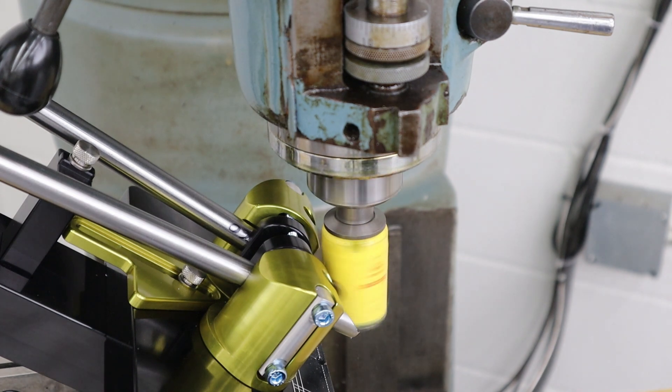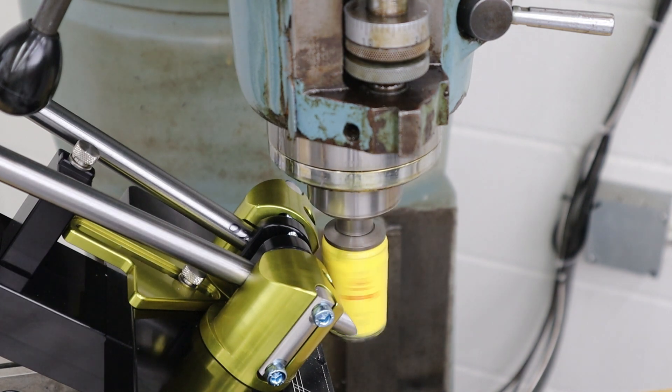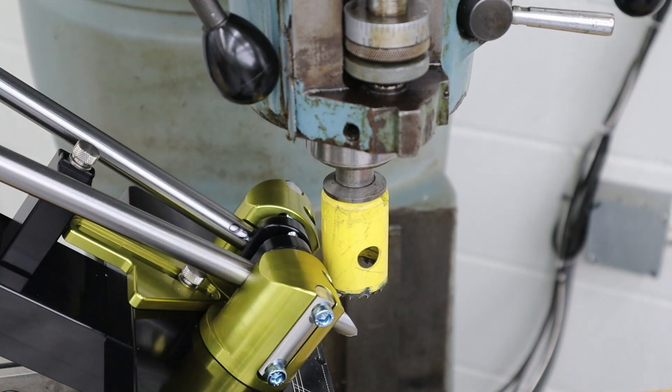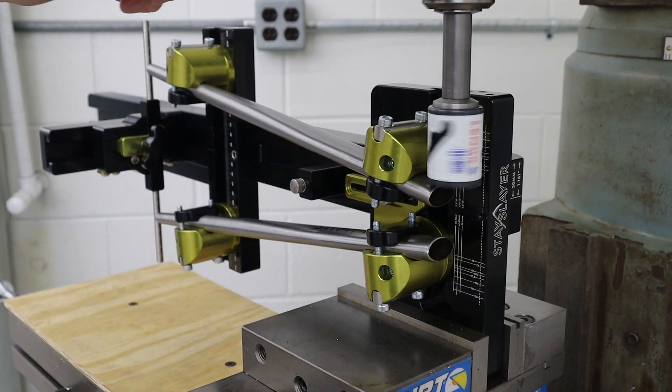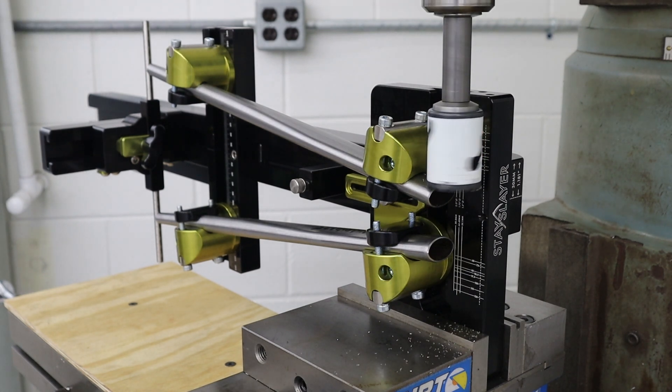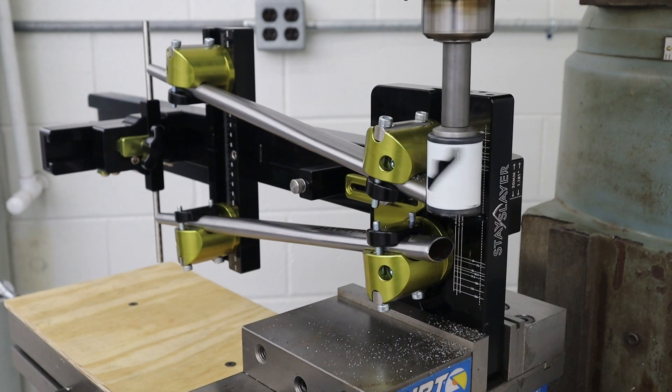It's important because even though you're just mitering thin tubes, as the diameter of the cutter goes up, cutting force gets higher and higher. Mitering tubes like this actually takes a fair amount of rigidity, and thin tubes are hard to hold rigidly in the first place. The rigidity of a mitering fixture like this is actually more important even than most welding fixture rigidity, though that's also important.